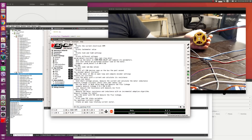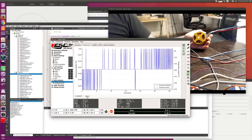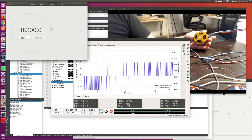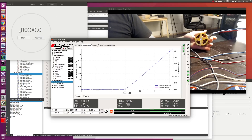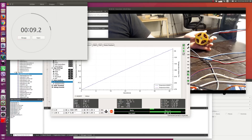Before we start, we're going to prepare the real time data at temperature. Switch on heartbeats which have to be on in order for the command not to time out. Start the command and restart the timer. As you can see, we're pulling like 70 amps and dissipating 180 watts of only losses in the system. So things are going to get really warm.